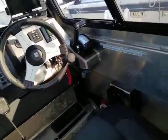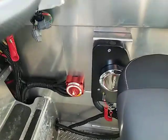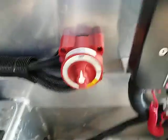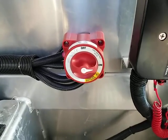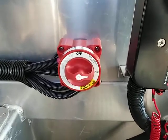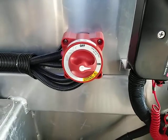The first step in operating the boat is turning on the battery switch. The battery switch is located next to the driver's helm and has two indents on it. The first one is the on position, where the boat is operated in normal operation. When the battery switch is in the on position, the two batteries on the boat are both automatically charged whenever the engine is running, and then both automatically separated whenever the engine is off.